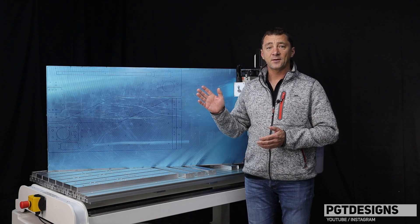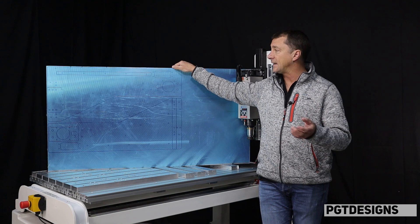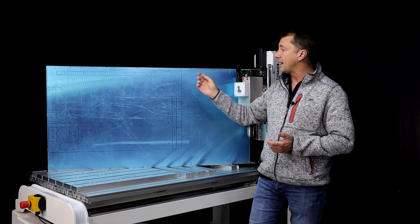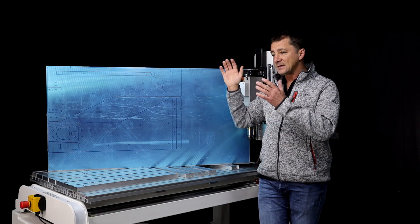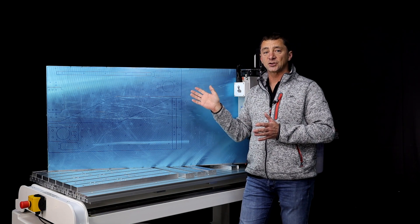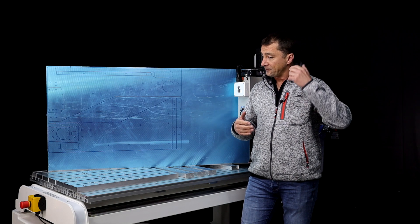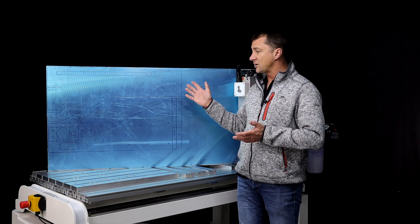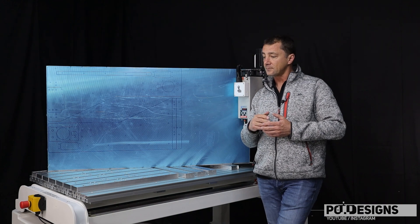Because it's a custom design I thought we'd go bells and whistles, so I ordered a big piece of aluminium. It is still C250 and still 20 millimeters thick, however this piece of stock is 1.2 meters long and 630 millimeters wide. I decided to experiment with different toolpaths and tooling strategies — this is the first time I'm machining stock and components this big on the executive machine.